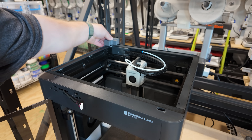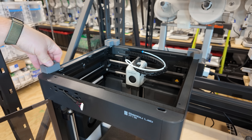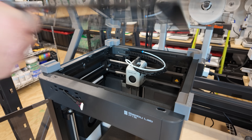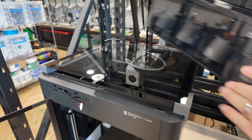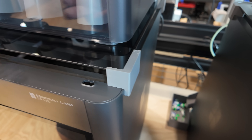My first recommendation comes with a disclaimer: I would only suggest it if you print with PLA and PETG material. This is a top vent or glass riser specifically designed for the P1S, to get your glass up, allow airflow and heat to escape when needed, but also retain the glass in place so dust and debris doesn't fall into your printer. There are a ton of different designs on Maker World, and the one I have is super basic — just some blocks to lift the glass up, allow it to vent, and hold it in place within my automated system which actually tilts the machine.